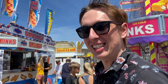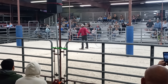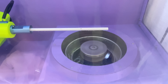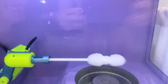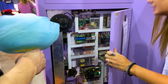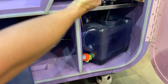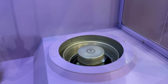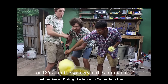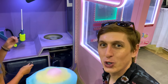By this point I was feeling pretty defeated, so I went to the county fair because I just wanted some cotton candy. I walked around, but I couldn't find a single person selling it, and that's because they've all been replaced by this. It's a CNC cotton candy machine that can make different shapes of cotton candy using a robot arm and some tools in the enclosure. You select the shape you want and the machine goes to work. Each color of sugar has a valve, and when that valve opens, the sugar gets blown through a tube into the cotton candy maker. This spinning thing right here is covered in tiny holes and has a heating element inside. When the sugar starts to soften, it's forced through all these tiny little holes, stretches out, and becomes cotton candy. Then the machine cleans itself out with water.